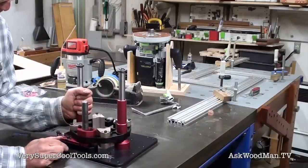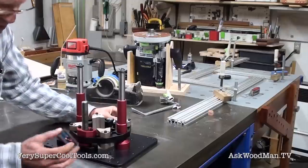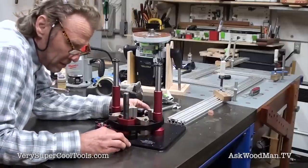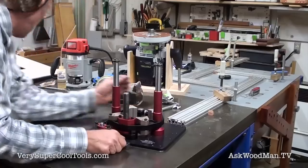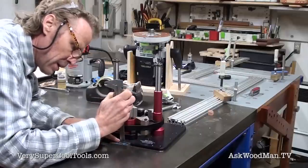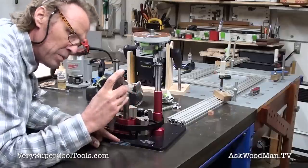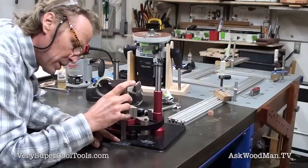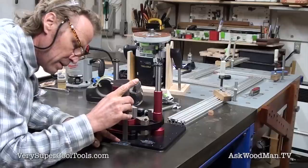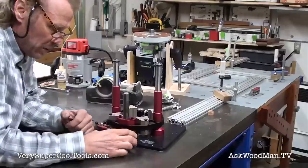When I put these two together — this square right here is a half inch. So if I route down exactly a half inch, that leaves me one millimeter of set-down that I can have some slop and play with. I'm trying to remove as little material as possible out of the plywood. That's right on exactly one millimeter.